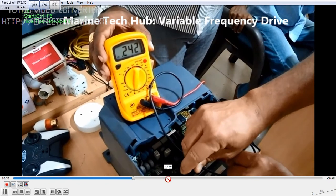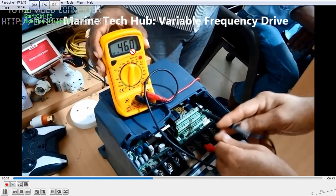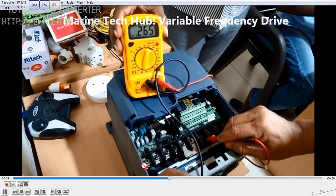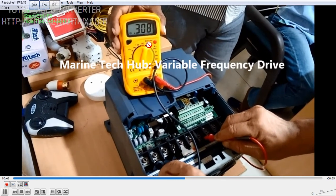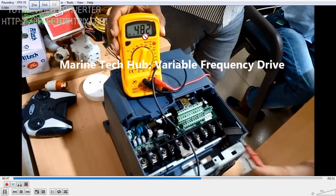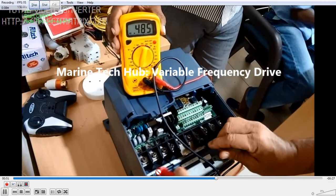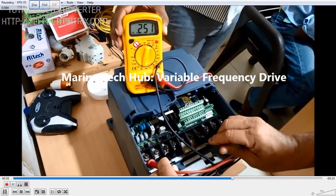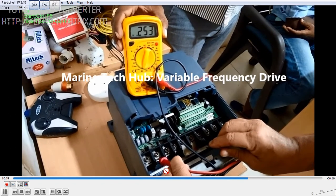You can see the other one: 0.24, 0.43. Let me show you again one more time. The first reading is 0.246, the second reading is 0.247, but the third reading is showing more — 0.482. So there is a problem here in the third reading. This is the inlet side of the unit.